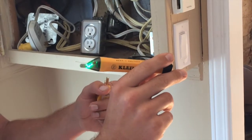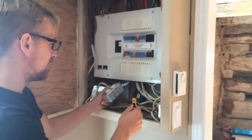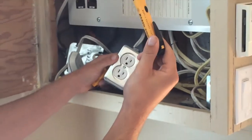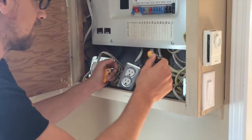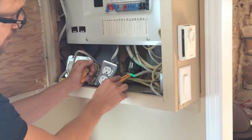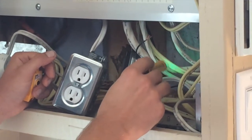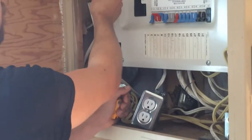It also works as a non-contact tester, which is perfect for wires. This is a panel at the customer's home. You can test it on the side of the wire as well. It indicates red when the circuit is on. This is great for any wires if you're demoing something in your home — any indication you need to see whether a wire is on or not. This one's off, as you can tell by the green light. The main cable here is on. It's very useful because it can actually read through the side of most jackets on NMD wires or household wires.